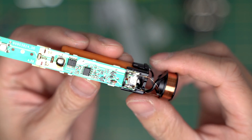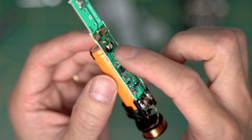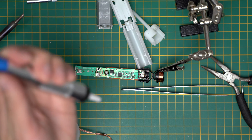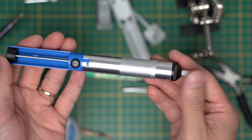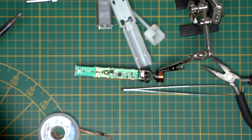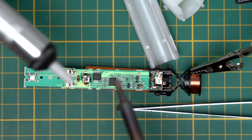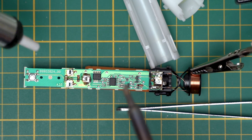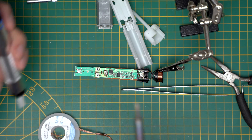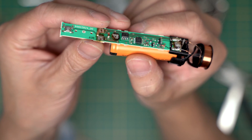It was probably much easier to desolder the battery fully. This time I want to use the solder vacuum — it came with my kit and I've never used it before, so let's see how this works. I'm still using the big tip. That works surprisingly well — got almost everything out. Now we can remove the battery.